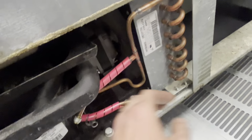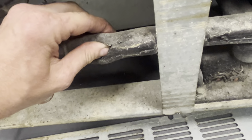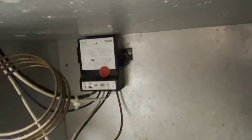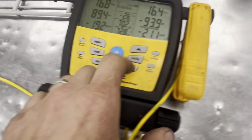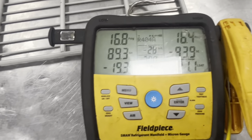We've got a hot discharge line. We've got a cold suction line coming back, and the temperature inside is dropping quick. So it's got this intelligent temperature controller. It may have a temperature probe problem, which is why I want an accurate T1, so we can know when and if this box satisfies.